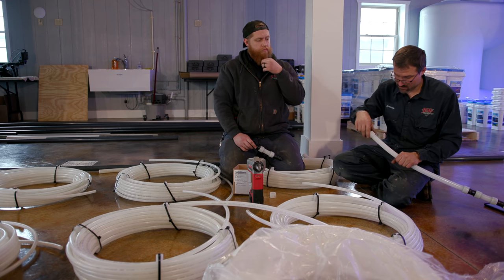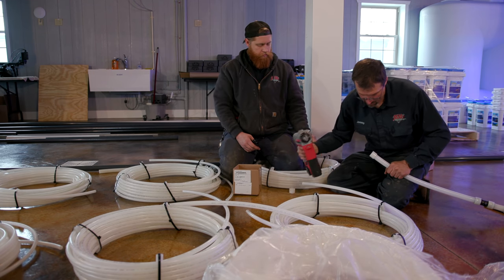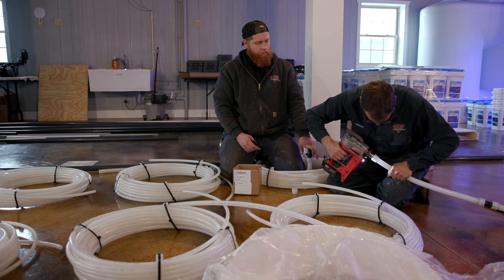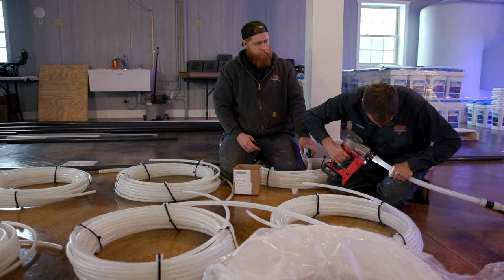What's sitting in the cistern currently is a heat exchange coil — around 1,000 feet of PEX coil — and we can expand that over time if needed. That's kind of the sweet spot based on our calculations. On demand, a system monitors the temperature of all the different aquariums and runs the heat exchange coils for just that system when necessary.